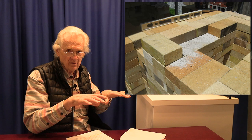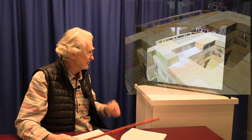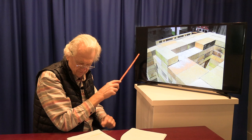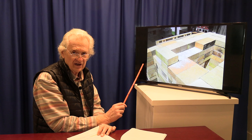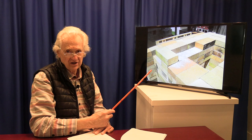As we were starting to raise the chimney, we realized the concrete base was probably not perfectly level and we had to level the bricks. So we decided to occasionally shim - put a little shim between layers of bricks. In this case, we used a small layer of dry refractory cement, a high aluminous cement. We just put a small layer of powder between the bricks to act as a shim to level it up. We only had to do this a couple of times.